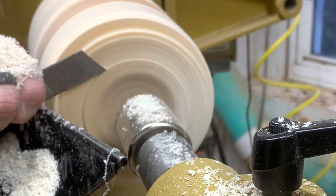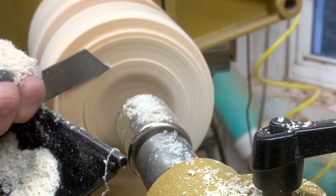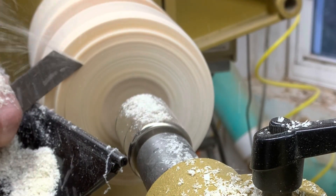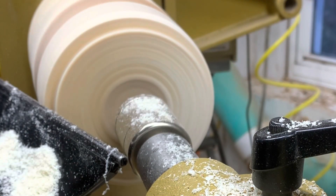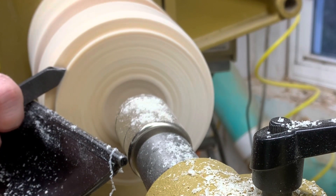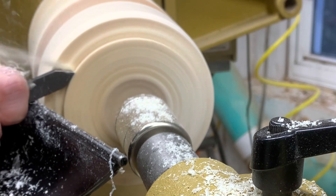Rubbing all the way down — see how I'm just rubbing the bevel, not cutting. Pick the handle up just slightly and then start cutting all the way in. Now here's a different parting tool — a beading parting tool. I use it just for parting. Same thing: there's the bevel, not cutting, rubbing, not cutting — pick it up until it starts cutting and then chase that all the way in.